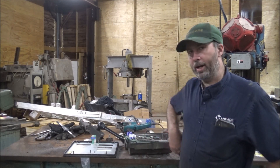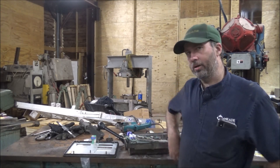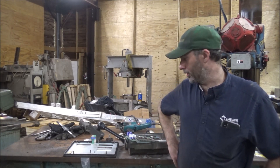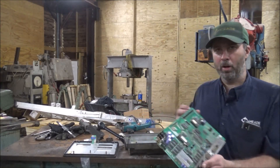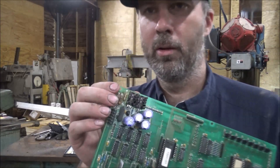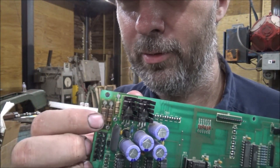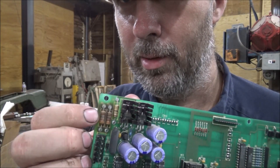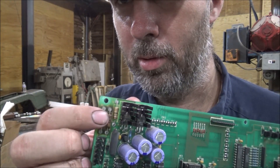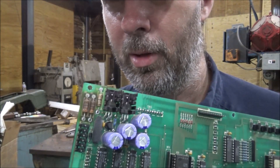But this digital readout — now that the temperature's gotten warm — it comes on and runs for a couple minutes and then it cuts out. I decided to tear it apart and take a look. The only thing I can find that's obvious is these two resistors here look like they've been mighty hot, looking at this board. So I'm going to replace those two and try that.